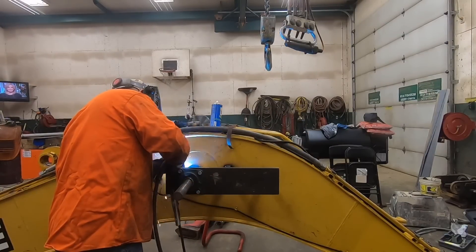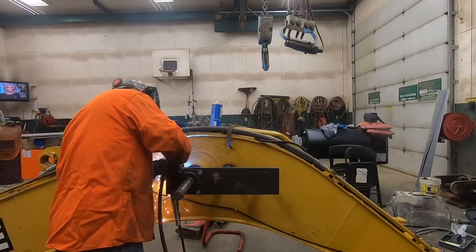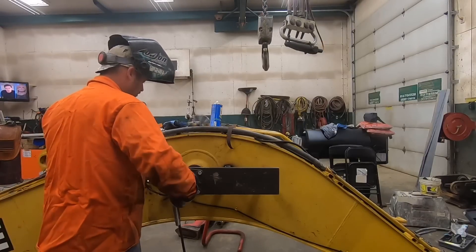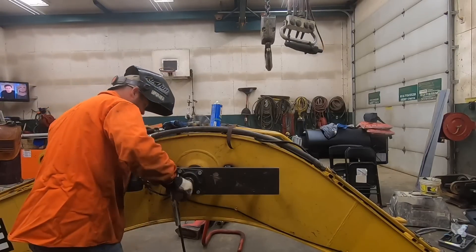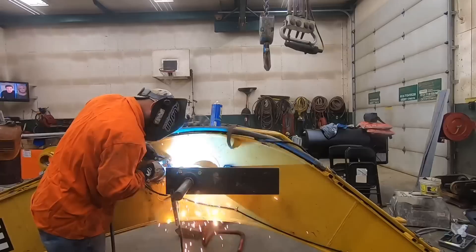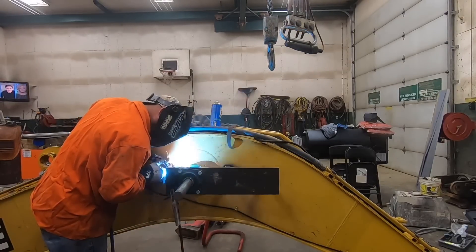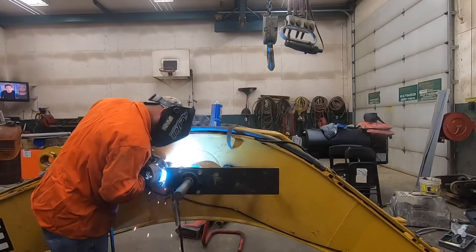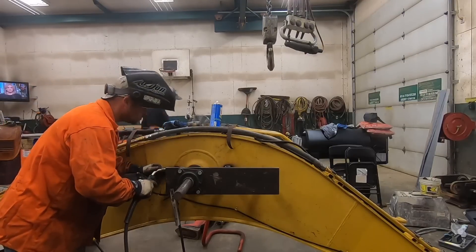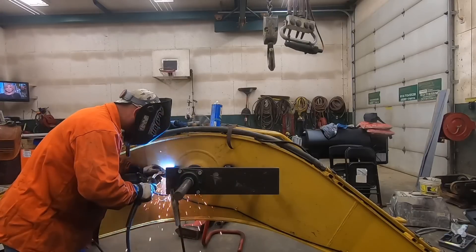The most important thing to realize is that this three-quarter inch plate needs to be mounted as solidly to the workpiece as possible. Even with three pieces of square tube holding it on, we had a little bit of deflection. In another video you'll see how we did the boring on the quick coupler, where we actually attached the three-quarter plate to a piece of half-inch plate directly to Mike's welding table and welded the coupler straight to that plate as well. That entire setup was probably the best we did the entire time — very rigid, with an almost mirror finish on the final cut.